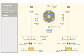Combined shock buffer relief valves maintain the system oil pressure within limits. The control box receives helm order from bridge and sends electric signals to the bidirectional control valve. Potentiometer senses the rudder stock position and sends a feedback to the control box.